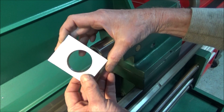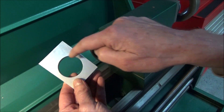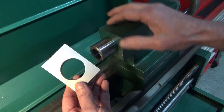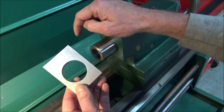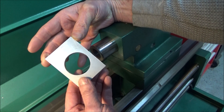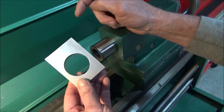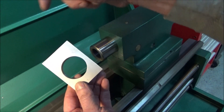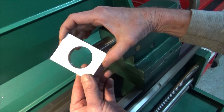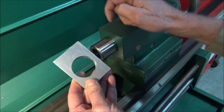What I need to do now is go over there and cut some off here. I'm going to mill it so I'll have the same distance on this side. My original plan was to take a slitting saw and cut it there to make a clamp-type thing. But what I think I'm going to do instead is just drill and tap two quarter-inch holes 90 degrees apart and do thumb screws, and I'm going to see how that works out. So next I'll just cut that off and get it milled.